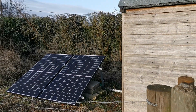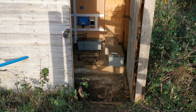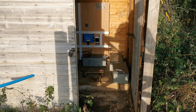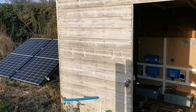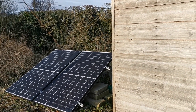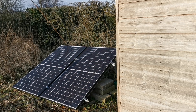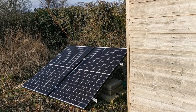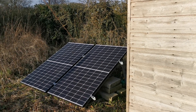What we had to do initially in October was get a generator into the shed. For a period of time I was running a petrol generator here with a battery charger, putting charge onto both batteries, and using a separate AC output to drive the pump while the generator was running. What I've learned is you can't base the design of your solar system if going off-grid just on 12-month historical mains usage. You really need to over-engineer it for winter - with enough battery charge to get through seven or eight days of very little electricity production.